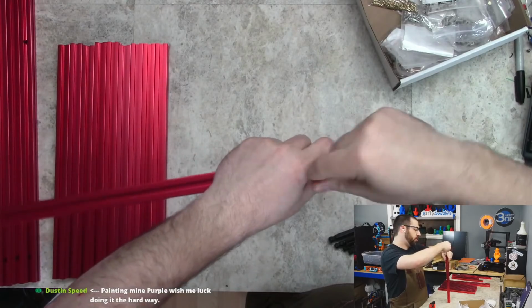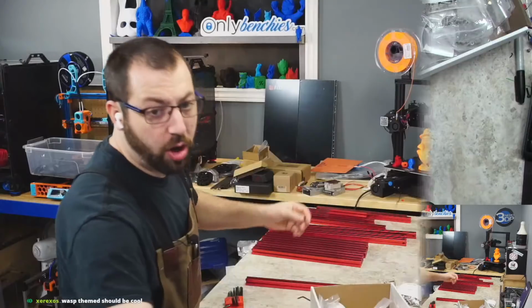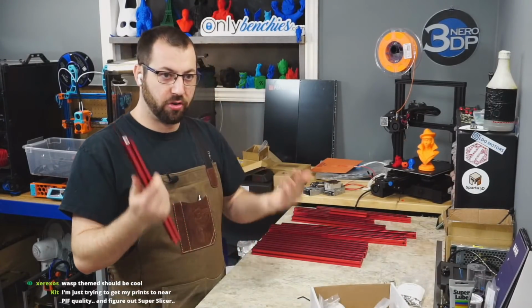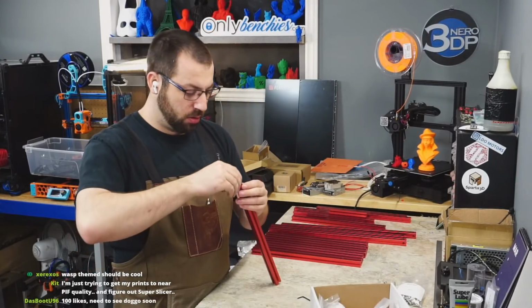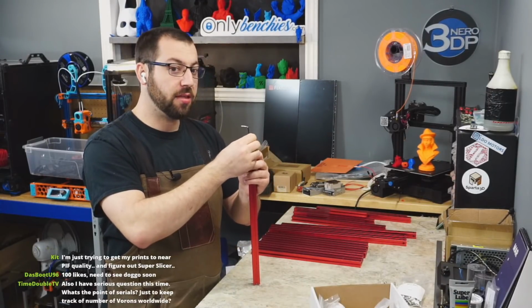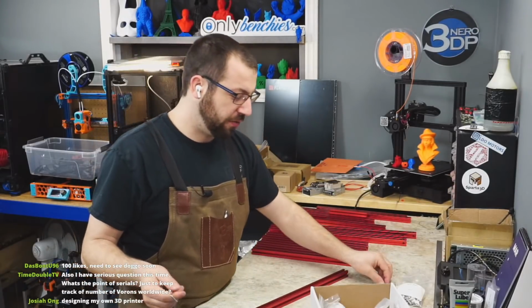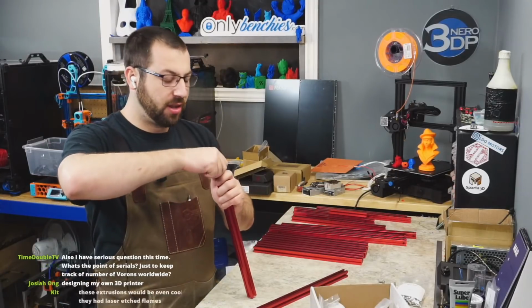Now, blind joints have pros and cons. Pros, they're super simple, because you don't need anything other than your extrusions themselves and screws. If you go with the Misumi corner cubes, they look really nice, but they're $5 each. So you're going to need 8 of those. That's $40 to your frame just for adding cubes. So it's a personal preference type thing.